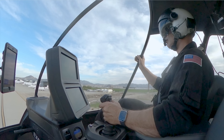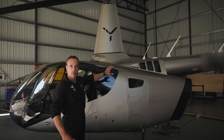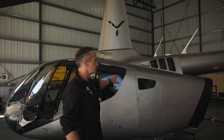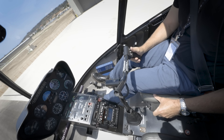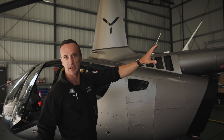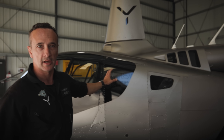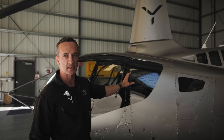This is an R66, which if this was a normal helicopter, we would have behind here push-pull tubes, bell cranks, yoke flanges, and everything else to have mechanical control from the pilot all the way through to the control surfaces of the main rotor and the tail rotor. But all of that is gone in here, replaced by a fully digital triply redundant fly-by-wire system.